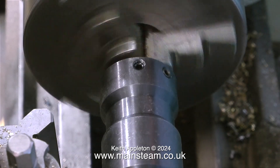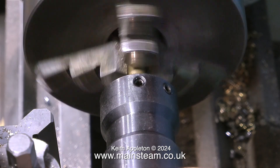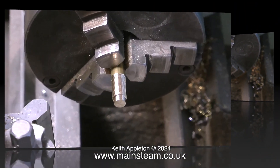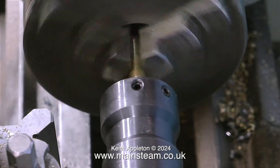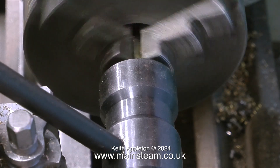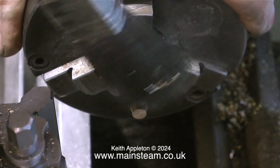The first sequence was in real time; now it's speeded up because life is too short to watch a piece of metal spinning round while I remove little bits of it. After many applications of the micrometer to confirm it's the right size and a nice easy fit on the flange. In this clip I'm threading the main part of the brass bar using my tailstock die holder fitted with a 5/16 by 32 threads per inch die. Normally I do this by hand but to save time I did it under power with the lathe in back gear. I ran the die down a second time with a bit of lubricant because the brass was squeaking. If you get a high-pitched squeaking noise when machining brass, use a little bit of lubricant.